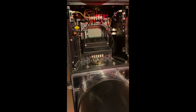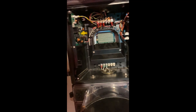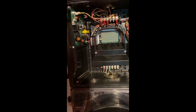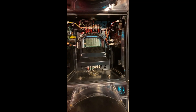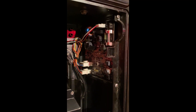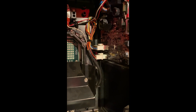Here's the interior — each section looks basically the same except that the terminal block for this signal is in the middle section. You've got a few boards here that operate everything. On the left you have a power filter board; that circuit board takes in the incoming 110-volt or 120-volt power and converts it to 48-volt DC. These signals can operate on 110V AC or 48V DC — if it operates on 48V DC, this board would be eliminated. The other board is called the controller board, and its function is to run the section — all the wires plug into the harness on the board corresponding to the different sub-circuits and the LED array.